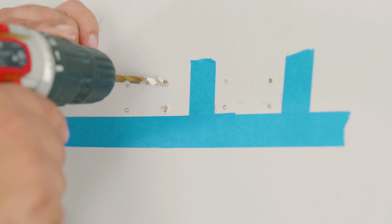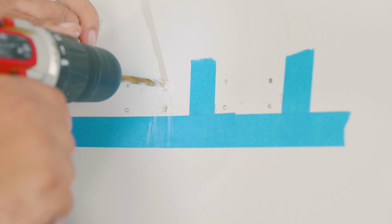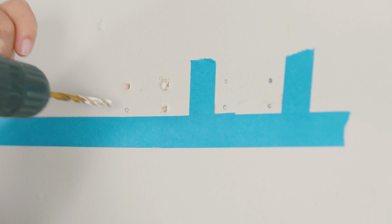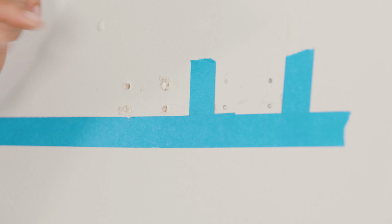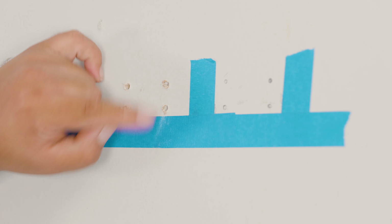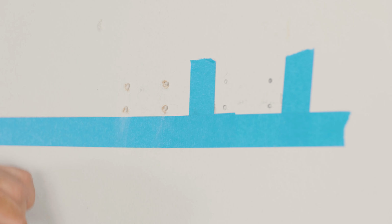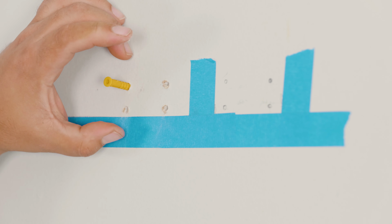So like that, no matter which way you choose, you can see how it's done. In this case, we're doing a hybrid, which also works well. If you have a long enough shelf that reaches from one stud to the other, and you have screw holes located at the stud, this would be the best way, because you can drill on both ends of the bracket on the stud. Another technique is if the bracket reaches the other stud but it doesn't have holes, in some cases you can drill a new hole on the metal bracket so it can land on the stud.